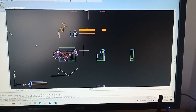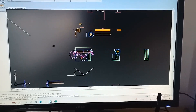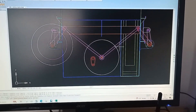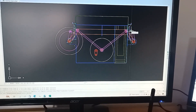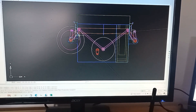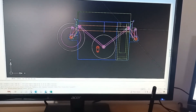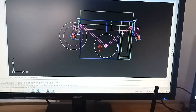Now I know what height I'm going to put the heat exchanger, I can actually start designing it. I use just a 2D CAD package — only in a basic function really — just to pull some various designs out to see a rough design. So I've got a diaphragm piston, flywheel crank, which also maintains a crank angle, and then the heat exchanger which goes right through the whole lot — from the hot side to the regenerative area to the cold side.